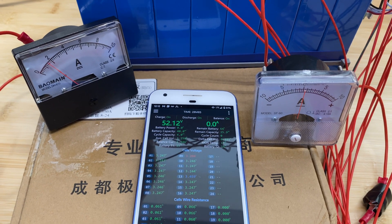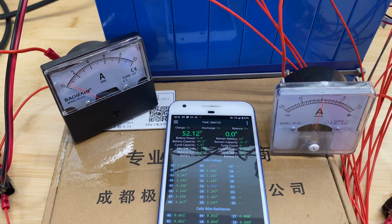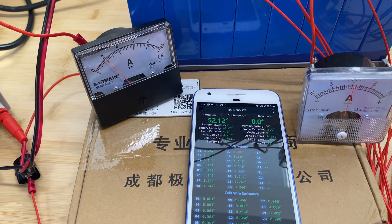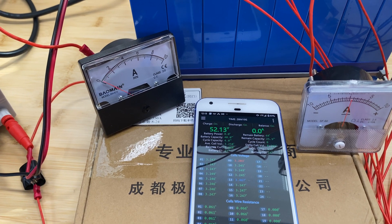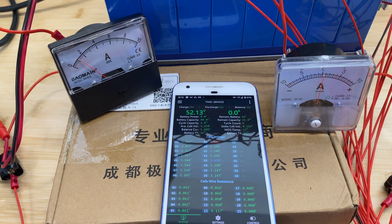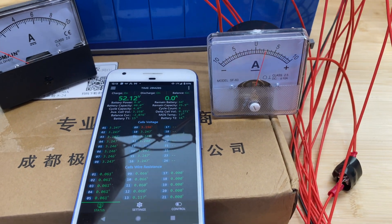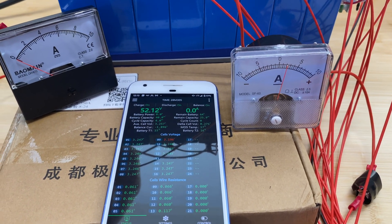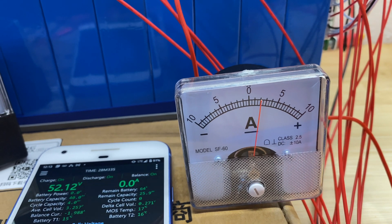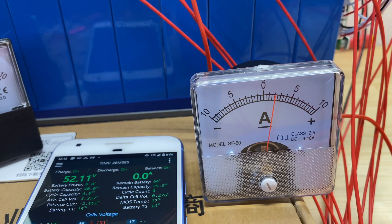On the left side you can see it's charging cell number 9 and it's close to 2 amps, but it's actually jumping — from 0 to 2 amps. And on this ammeter you can see that we're pulling from cell number 13 also 2 amps, but it's also jumping. So it's not constant 2 amps — it's changing.